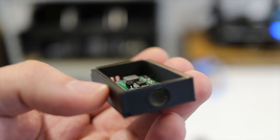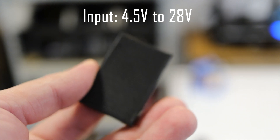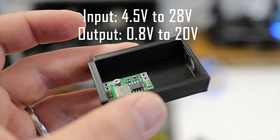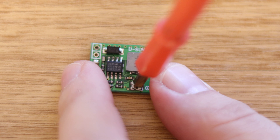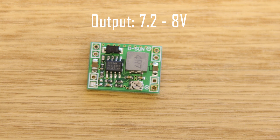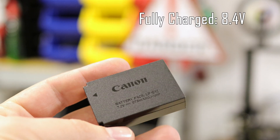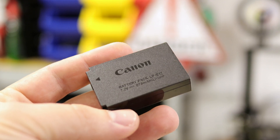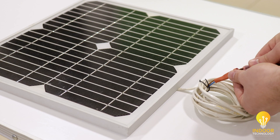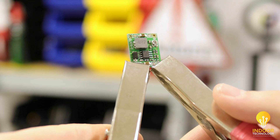With this $2 step-down module, I can plug anything from 4.5V to 28V, and output anything from 0.8V to 20V, and that's more than enough. The voltage of the output can be modified by this adjustable resistor. I know my output voltage should be around 7.2V, and I have room for error. As the original Canon battery, when fully charged, has 8.4V, and the minimum is probably around 6V. The best part is that I can put any input up to 28V, and it will output the same — so I can plug it into my solar panel, LiPo battery, or even directly to my car battery, and it will work just fine.